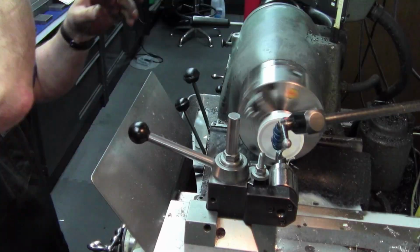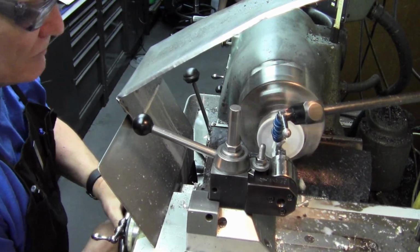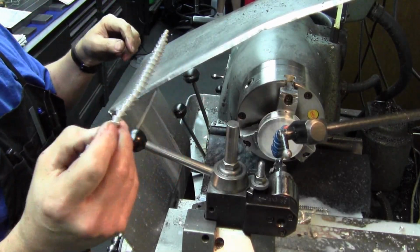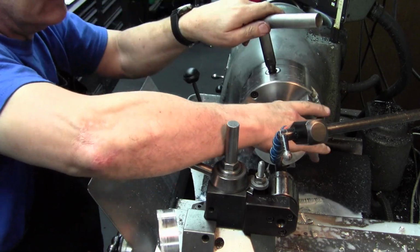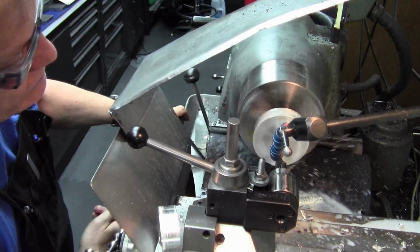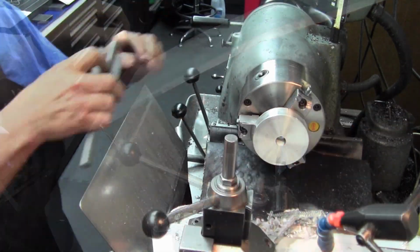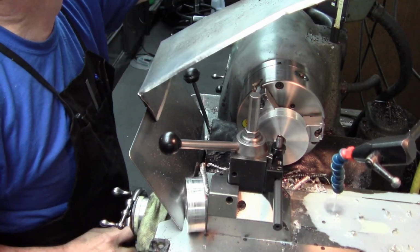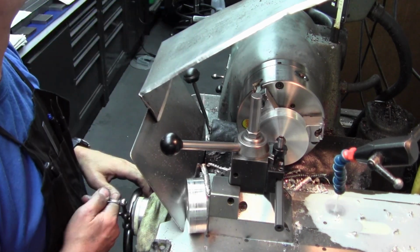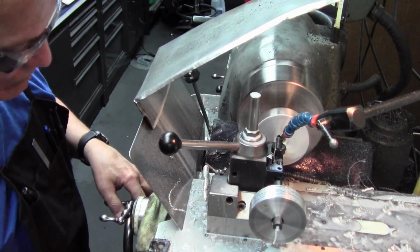And now we're whacking the holes in there for the expander. Little makeshift coolant spray guard there. Just like the grinder, I just use coolant all the time on the lathe. Just doing too much work that requires the benefits of coolant, turning a lot of tool steel, and just one of those things that if you're actually producing a lot of stuff, you just got to use it.